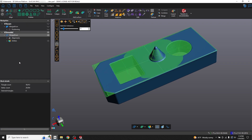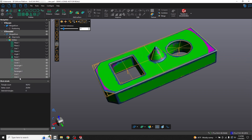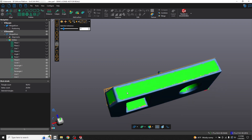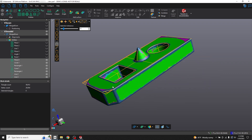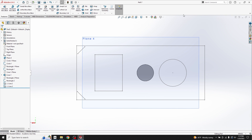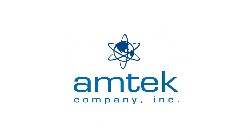The only thing left is to actually send it to SolidWorks, so I'll cancel out of this tool. Under entities, I'll select all of the entities I just created to define the geometry of this part. I don't need the alignment entities since those were only used to align to a coordinate system and that alignment will carry over to SolidWorks. Since I aligned the bottom to the origin, I can just extrude from the origin up to plane four. Now that I have everything selected, I'll click transfer to SolidWorks — and that's going to send over everything I'll need to recreate my part. Be sure to check out our next video in our Creaform series on how to rebuild this part in SolidWorks. We'll see you soon.